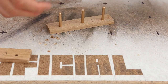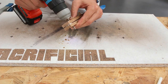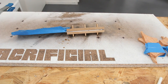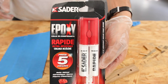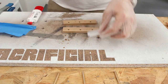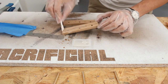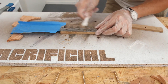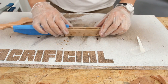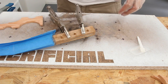The strength of epoxy glue is no joke, so before moving forward give it a quick test — assemble it and make sure everything runs smoothly. Make sure the window is open. The glue will set in less than five minutes, which is more than enough if you are prepared, but definitely too short if you run into problems. Prepare epoxy glue following the instructions on the package, then apply a coating on one scale, add pins, spread more glue, then the blade, spread more glue, then the second scale. Tighten it as much as you can with clamps and let it dry.